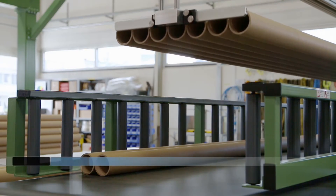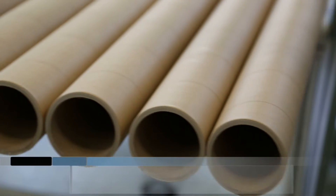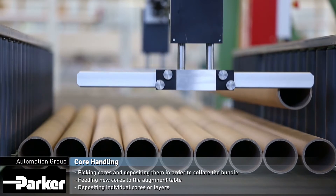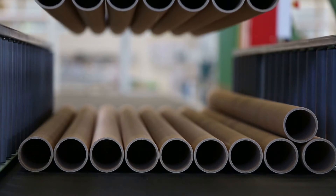In a first step, the cores are picked by a pin gripper and deposited on a conveyor belt where they are collated and bundled. Parker HLE linear actuators are used for all vertical and horizontal movements in this step. The P1DS pneumatic rod cylinder is used to drive the gripper's pins into the cores.